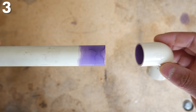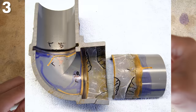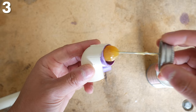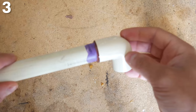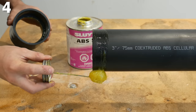The third mistake is not twisting the pipe a quarter turn after it's been inserted. This is the main reason why glue joints leak or come apart. The reason it's mandatory is to ensure the cement is properly spread throughout the whole joint — just pushing it in will increase the chance of not getting full coverage. If it cannot be done, apply more cement on the pipe and fitting, but note that it will take longer to set, so hold them together a little longer than you normally would.